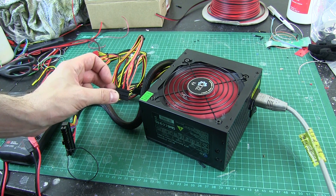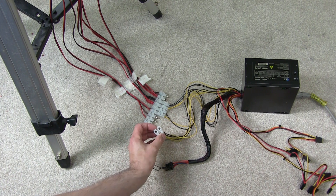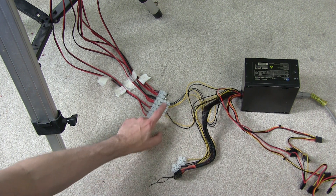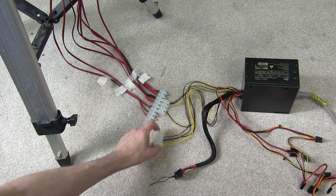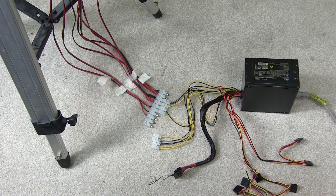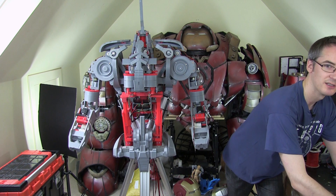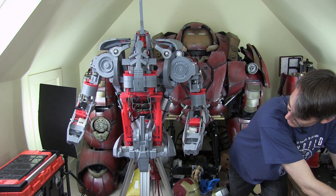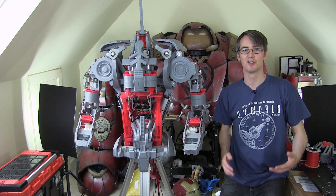There's also an orange wire on some of the other connectors which I think is 3.3 volts. I've broken out the 12 volt wires and I'm using these chocolate blocks which are pluggable - one half has pins, the other half has sockets. I've powered up the left hand side and I've got two more connectors for the right hand side, with five volts and extra 12 volts spare. If I twiddle the knobs we should see the arm moves - and it all works. I'd assume since power is good the other side works as well.